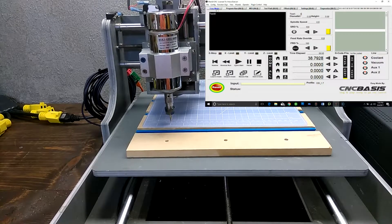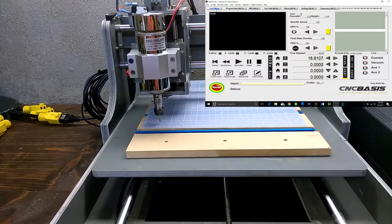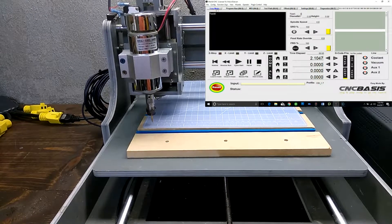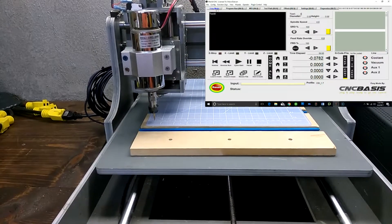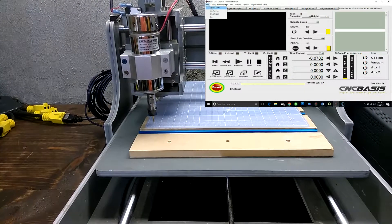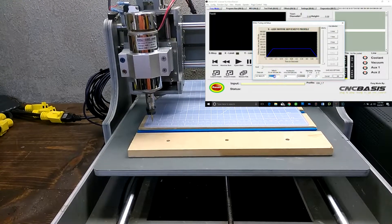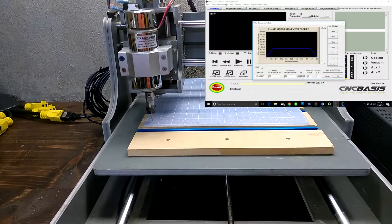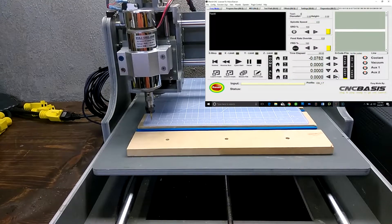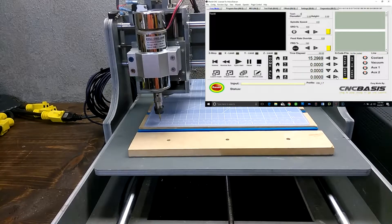You may notice the speed for the axis is different. You can adjust this by going to Motor Tuning. In the selected axis, set the Velocity and Acceleration of your preference, then save axis settings and click OK. Follow the same procedure for Y, Z, and any other axis.